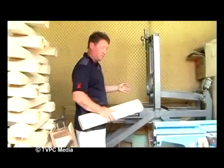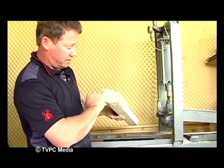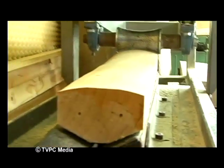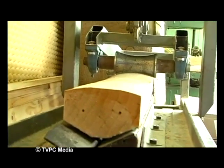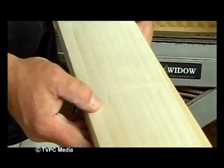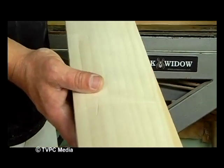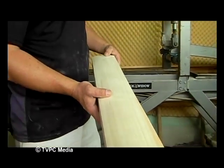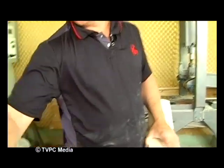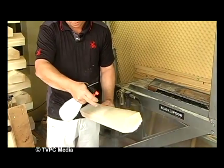This is what's called the press. The angle taken off the face is the same angle as the roller used on the press to compress the wood. English willow is exceptionally soft — you can put your nail through it quite easily. When people say that top players' bats aren't pressed at all, that's very far from the truth. They have to be compressed, with different approaches used for different players. The wood needs to be wetted first — we don't want it cracking under the pressure.